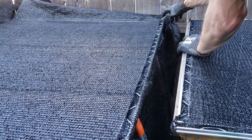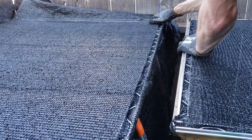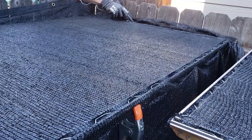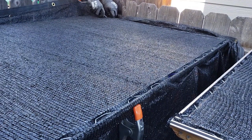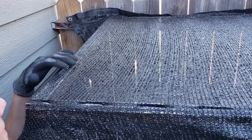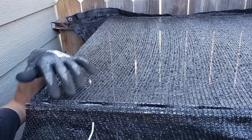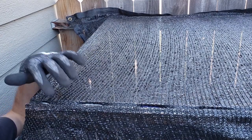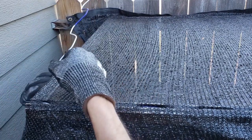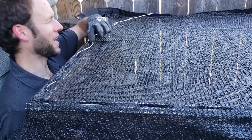You can see I have a little extra there that I needed to trim off. I'll snap that in and then we can do the two sides. I'll start with this side since it's a little tighter here and harder to get to. Now we have this last side that's not attached, so we can put the wiggle wire in here and then I'll be able to trim this down flush to this end and it'll look really nice. I'm just going to slightly pull this as I go to make sure it's tight. You can see the wiggle wire kind of naturally pulls it tight but I just give that extra little bit to be safe.